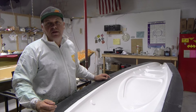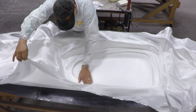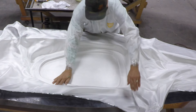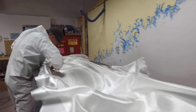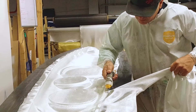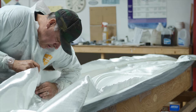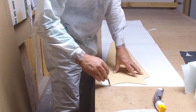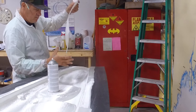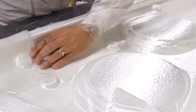This is a composite boat using three — actually four — layers of material. The first layer I'm going to put down is a six ounce fiberglass. The second layer will be a nine ounce fiberglass. The third layer will be a structural reinforcement that we put in high stress areas of the boat. It's called SORIC. It's a two mil thickness and it's a honeycomb pattern — a pretty cool pattern that lays in the boat.